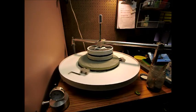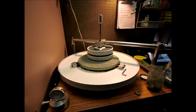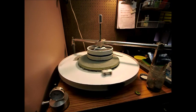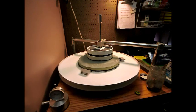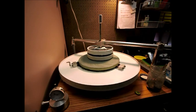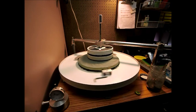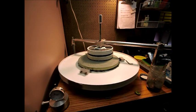This should be a short video on fine grinding. It's really no different from rough grinding except you've got to be a little bit more careful when you're placing the tool onto the blank, onto the mirror, and you've got to be more cautious of dirt or contamination that could possibly get into the system.